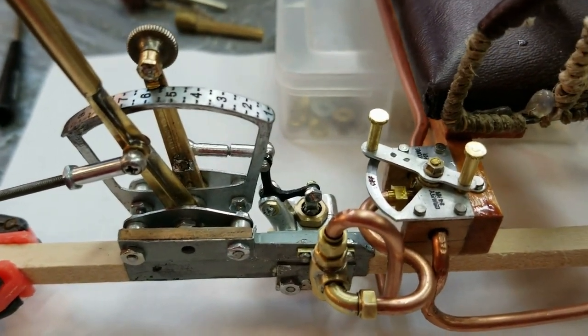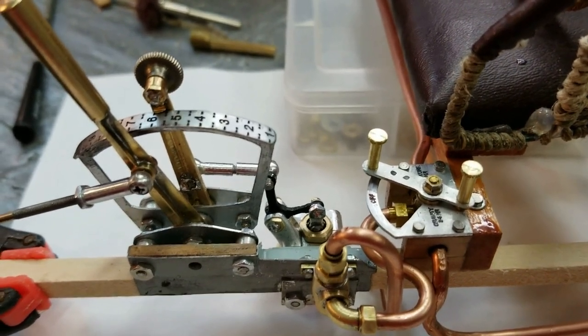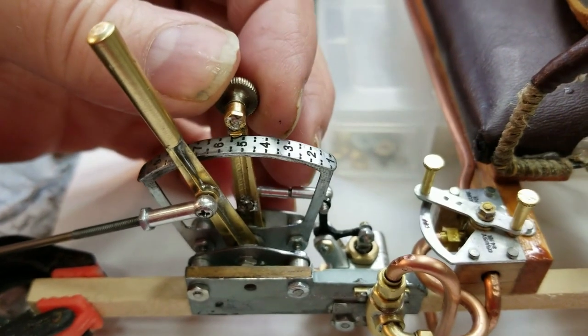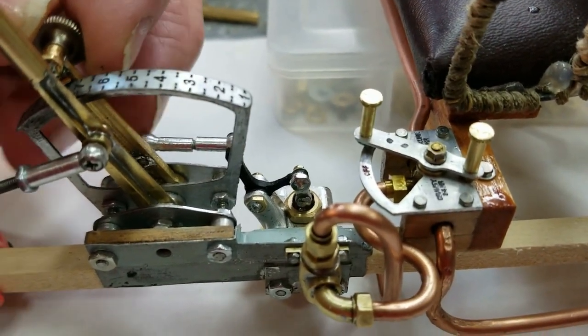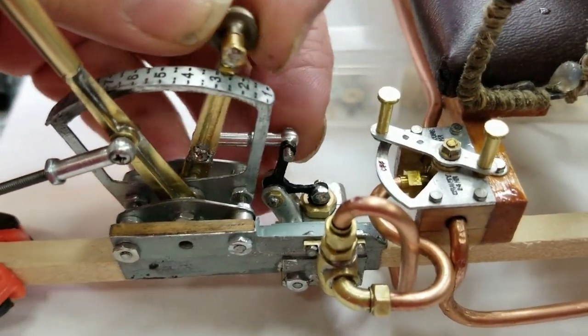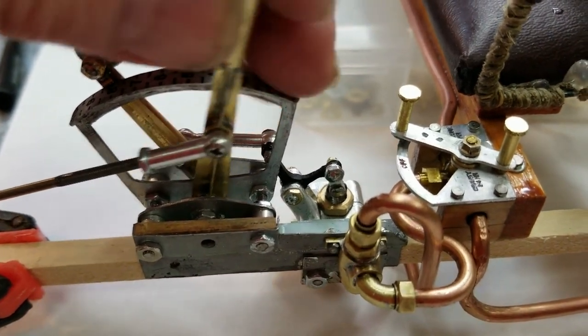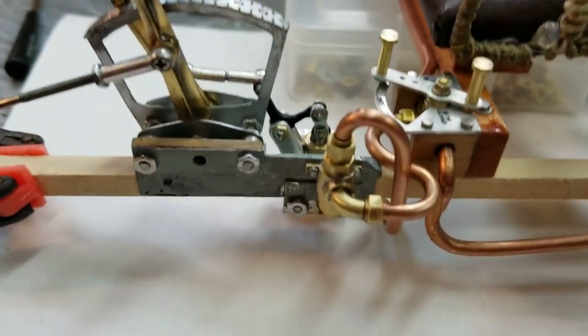The pressurized tank lasted for 3 hours. The gravity was 3/4 of an hour. The fuel flow is adjusted here through the valve underneath. That adjusted the fuel to the engine. This adjusted the airflow to the engine. And the plumbing comes in through the valve.